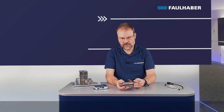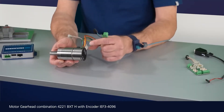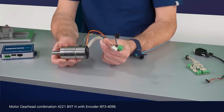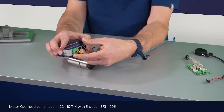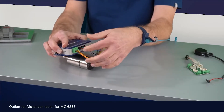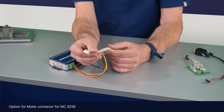Next is a motor with prepared connectors for the digital Hall sensors and the motor phases, and it additionally has an incremental encoder. In that case I use all three connectors on the motor side — I can directly plug in the motor phases and the Hall signals into the driver, but my encoder is equipped with the wrong connector.